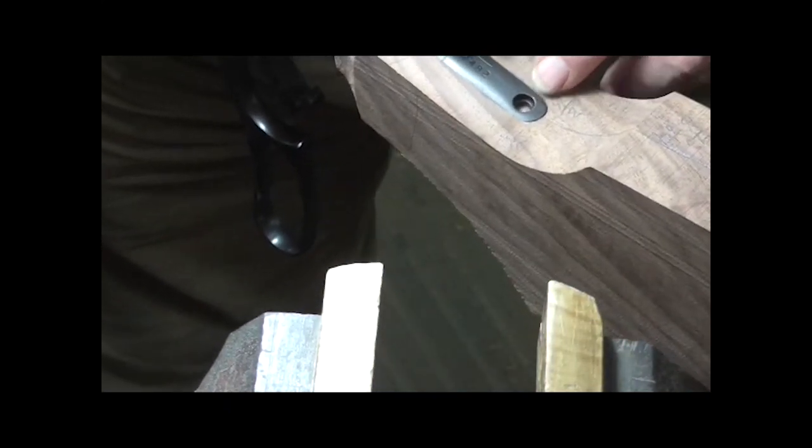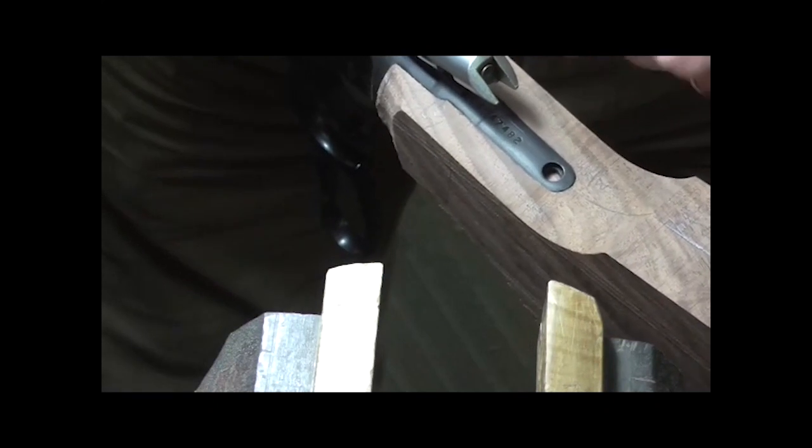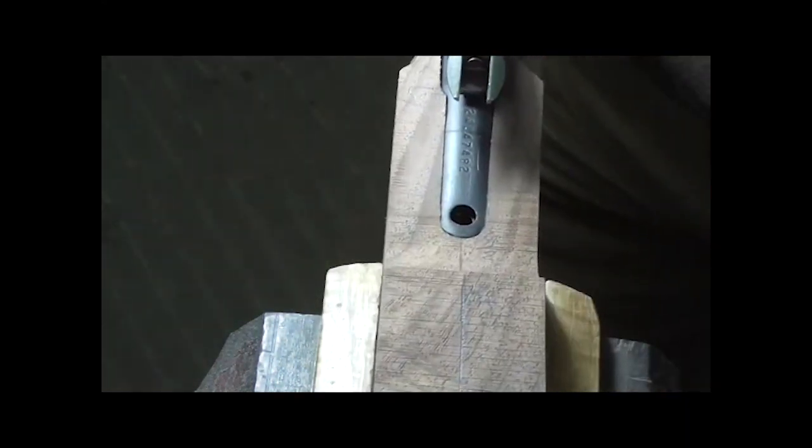So that's a pretty precise drill. What I'm going to do is drill a lot smaller hole than I need in this top. See, the threads are in the bottom down here. I'm going to drill a whole lot smaller hole than what I need and get my location of those threads. And then I'll enlarge the hole. And if I have to, I'll ooch it this way or that way, whatever it needs. But I'm going to start with a smaller hole, about half that size. That's nearly a quarter, but I'm going to start with a lot less than that.